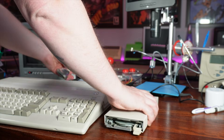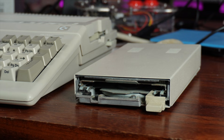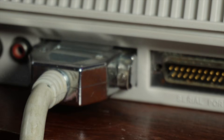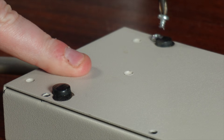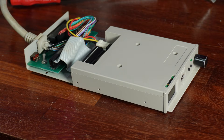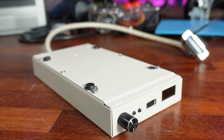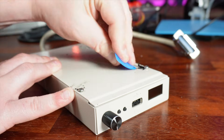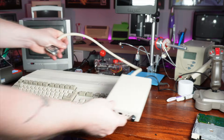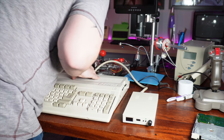I've picked up an external floppy drive from my friend Fuzzy Lee — just a standard 720-kilobyte drive inside an external enclosure with the power and data pins mapped to a D-type connector for the back of the Amiga. Since the Gotek is designed as a straight swap for a standard floppy drive, we remove the original drive and insert the Gotek instead. That's a pretty good colour match — it almost looks factory, save for the dissolved rubber feet. I'll get the remaining feet off and replace them with fresh ones so it doesn't rattle around the desk. With that done, we should be able to connect our Gotek to the Amiga and use it as an external drive, which presents us with our next problem.